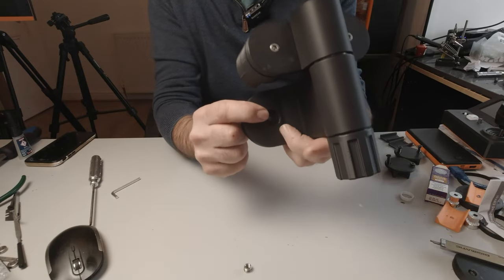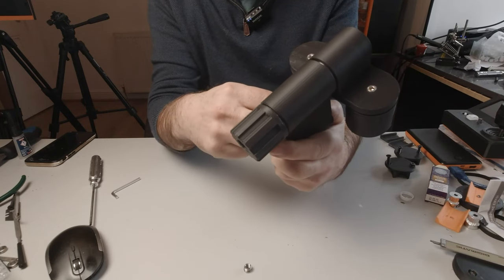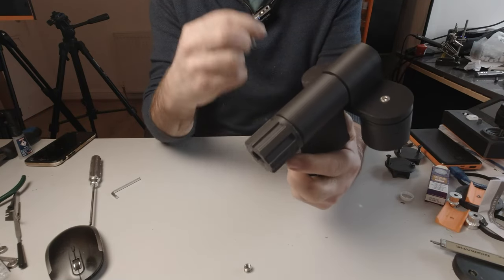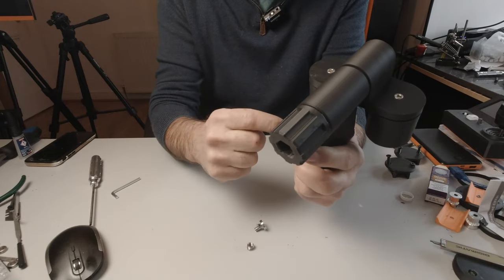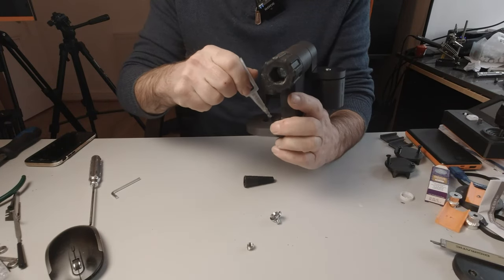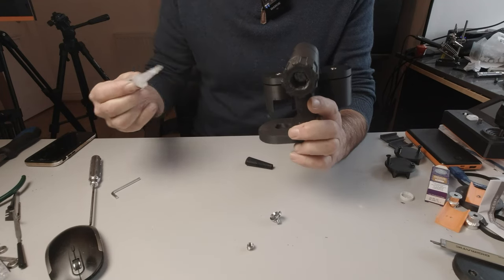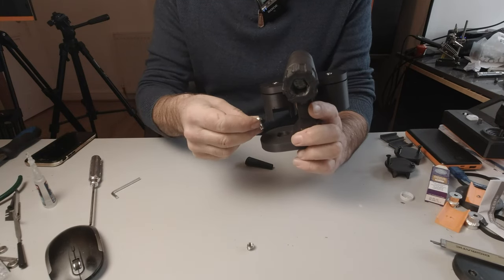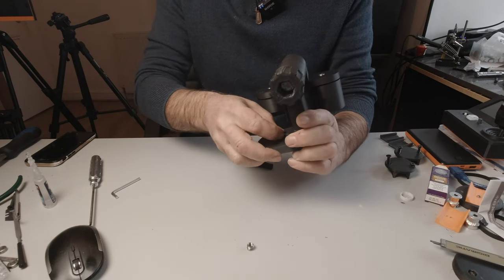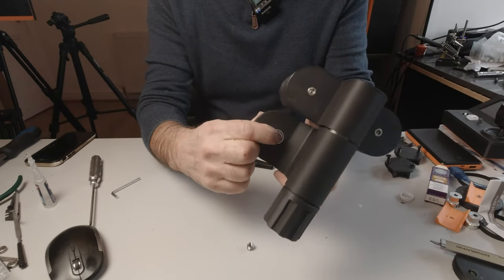In the bottom of this plate there's the equivalent shape for the back of that screw — it should just fit in and drop down. Put a little bit of super glue in here first, because when the adapter isn't on there's a tendency for the screw to fall out through the hole. Add the super glue, drop the screw in, and press it down into place.